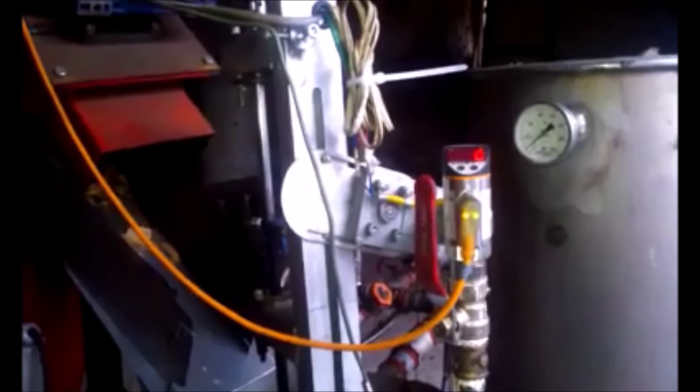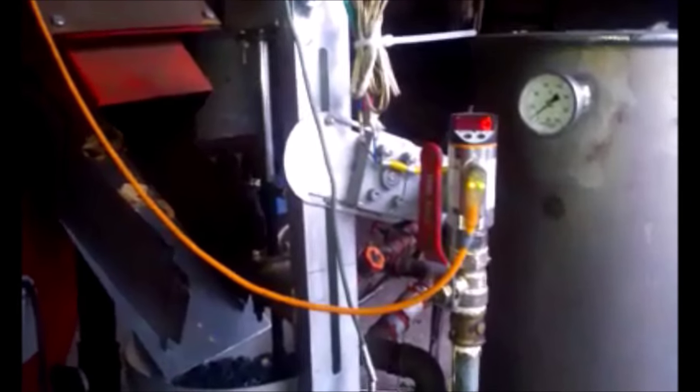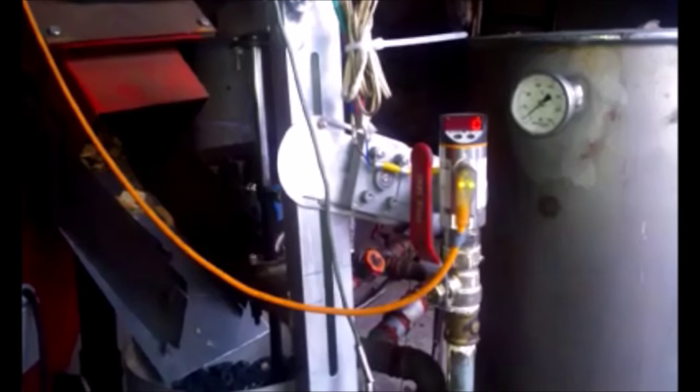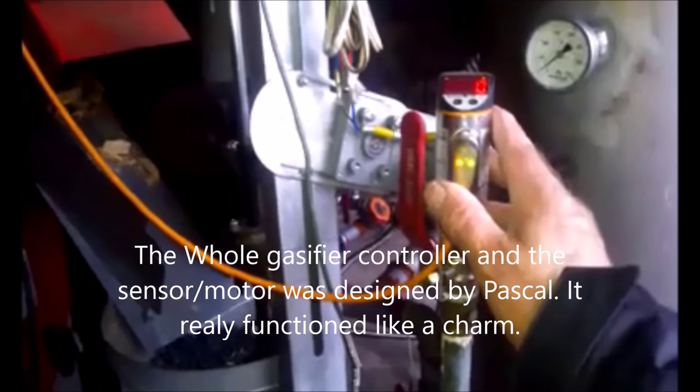Now, in a grate system, a gasifier with a grate, you can shake the grate, or if you have a driving gasifier, you can drive on bumpy roads. But in a grateless design like this one, with version 3 I have introduced an anti-packing device. We monitor everything, the packing. I can do that by an under pressure sensor.